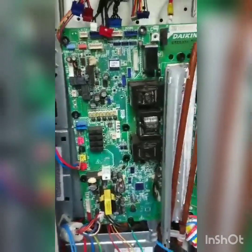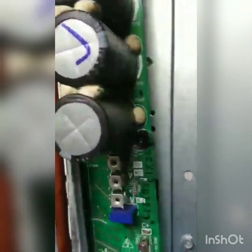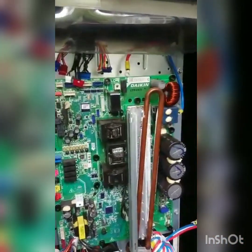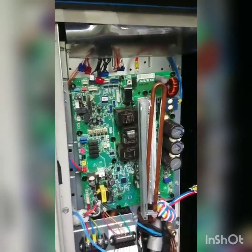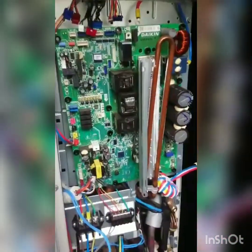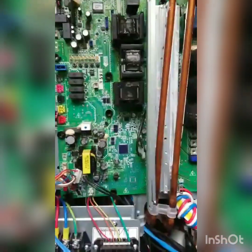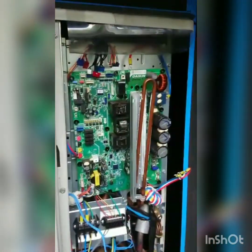All the screws are out - there must be about 15 screws. Just bear in mind there are a couple that are hidden: there's one underneath that transformer, and there's another one just around the back. You'll know you've got them all because the board falls away from the back plate. To remove it you simply slide it up out of the way. If it doesn't fall away from the back plate, that's probably an indication you've missed one of the screws - there are a couple of hidden screws just underneath the transformer and on the right-hand side of the capacitors.